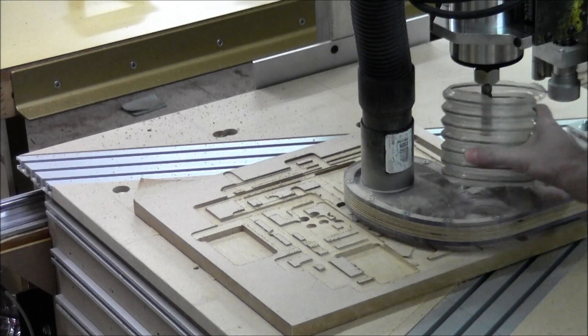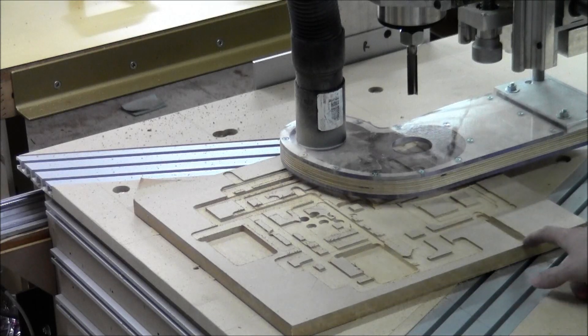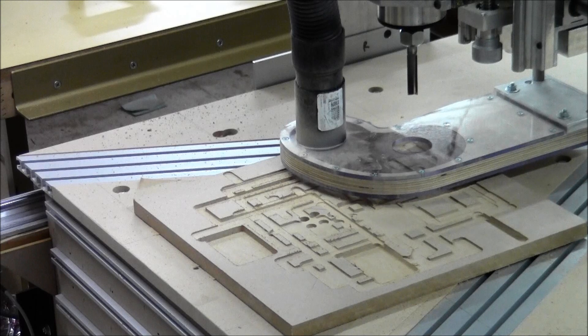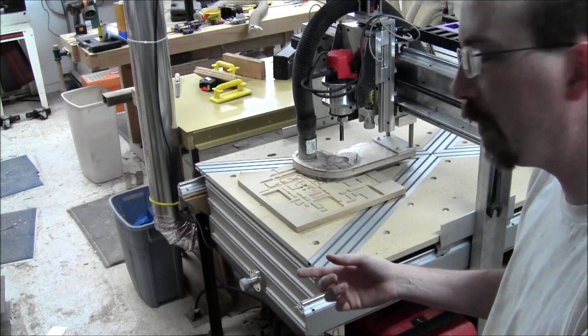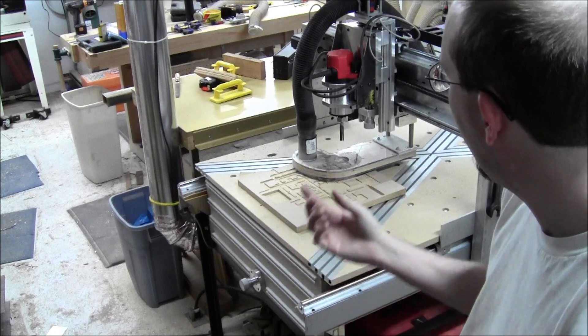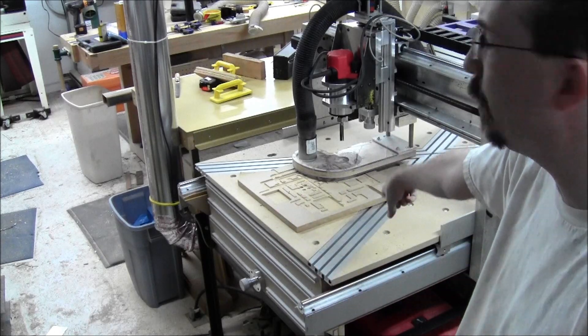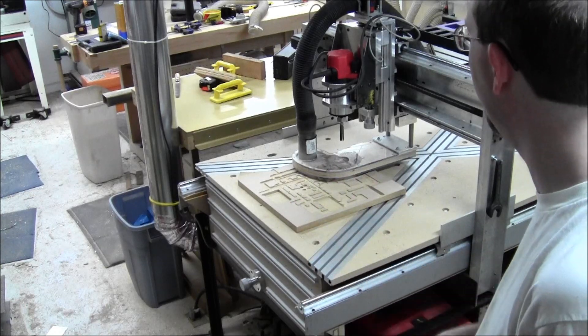I think this is my best bet. I will do nothing to modify the shoe. There is a little left in the trough, but it's not that much, and I'm willing to concede to that just a little bit. I'm not sure that opening the hole is going to help, because right now there's already more intake surface area than what the hose uses. The amount of opening is more than 150% of the hose — the hose is a 2-inch inner diameter, and I've got a 2-and-a-quarter inch hole on the bottom and an inch and three-quarters, so essentially about 4 inches of opening — basically around double the surface area.